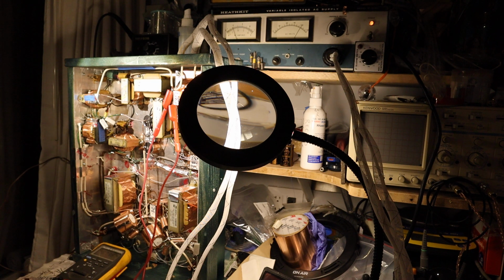Is it good or not? So if you check the tube manual, you will see that a 6J4 or any other version of it draws 0.4 amps of current. And we have two of them, 0.4 times 2 equals 0.8. So we are exactly drawing the expected amount of current, which is a huge thumbs up, right? There is nothing else in the circuit that's drawing extra current, and that's also one of your check marks to establish how much current you are drawing.